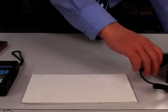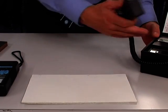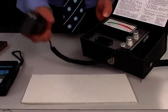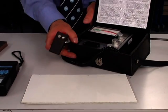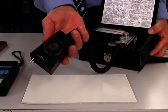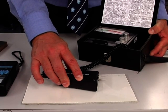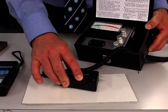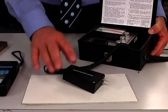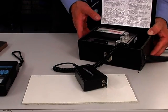Same with the Sovereign meter — we stay on scale A. The technology within the Sovereign is slightly different. Again, we start by setting the meter to zero, then the probe gets placed onto the fiberglass and pushed down, and we're getting a reading on the comparative scale on the Sovereign of just over 10. There's no direct correlation between the two meters in this respect, hence the term comparative or relative scale.